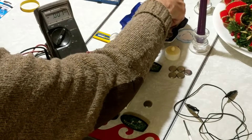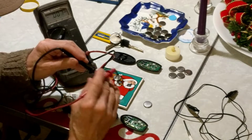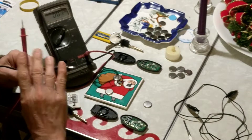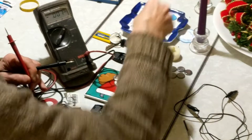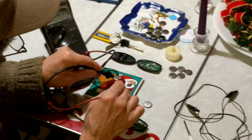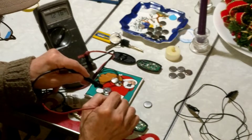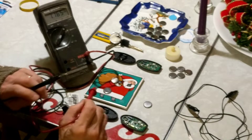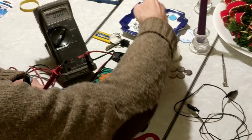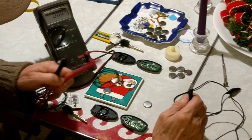I tried quite a few batteries. I tested their voltage and tried to find one that was pretty good. Here's an example of a battery that's 2.92 volts — that seems pretty good. Another one is 3.07. The dealer battery is 2.99. So this one is actually higher, but this might have been in the category where it didn't actually work. I tried a couple and none of them seemed to work, even one I had selected for a high battery voltage.